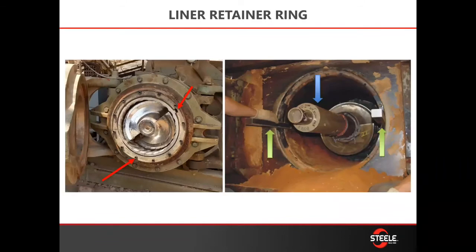On the left we see the clamp ring exposed — this should be removed first. Notice the liner key position before removing the liner. Using the adapter and the installation tool, as shown on the right, it will help you clear the front of the barrel and keep your worker safe. You can get it out and away from the front end.